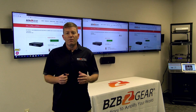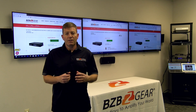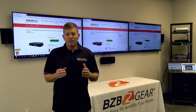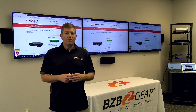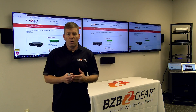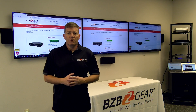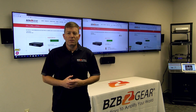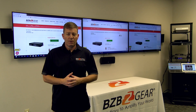When it comes to audio, this unit supports audio from the HDMI and DisplayPort inputs. However, for VGA there is a stereo 3.5mm input you can plug in. But if you're going to use the component or composite inputs, you will need to parallel your source's audio to a proper amplifier or active speakers, as it does not support audio for those particular video inputs.